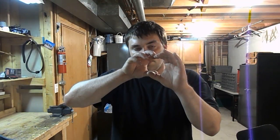I did the first clean, looked in the barrel, and noticed very visibly that circular ring. You could actually see where the rifling was slightly deformed, which was visible to the naked eye. Even if you can't see the rifling twisted a little bit, if you still have that circular ring, it's still deformed a little bit, which can still cause accuracy issues.